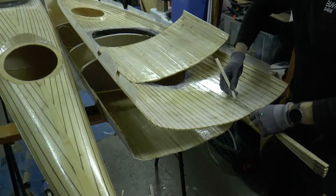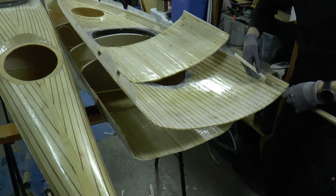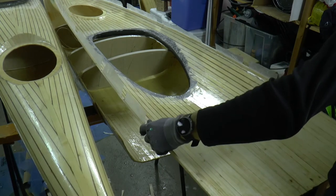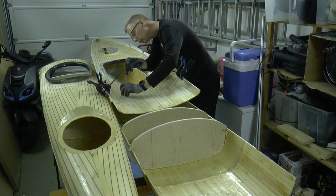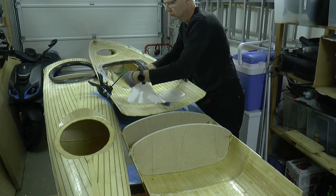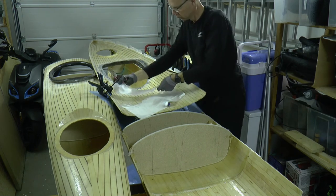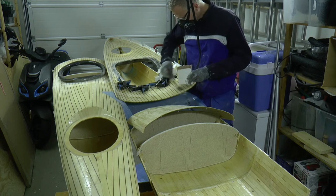The procedure is repeated with the deck. I measure out 10 cm overlap. Dry fit and notice problem with the bend at the deck edge. Brutal force using clamps gets the deck in place, but also results in some small cracks. All steps are dry fitted before the final gluing. There is little time to adjust problems when the curing has started. Now the gluing.